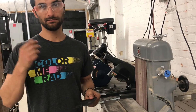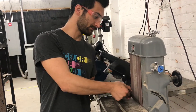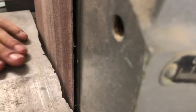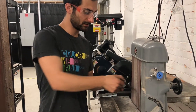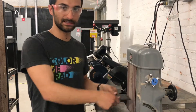In terms of safety, you don't want to wear gloves, you don't want anything that can get in there, and you don't want to use really thin metal that could slip in. There is a fairly big gap between the table bed and the belt, so you don't want something that can easily get sucked in there. If you're using something thin that could go down there, make sure you're holding it up so you're not risking that situation.